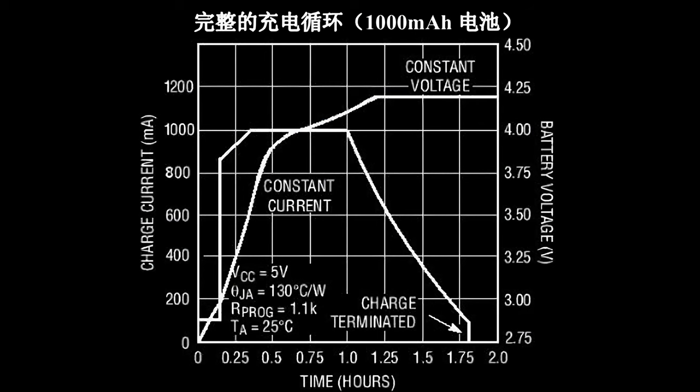According to the datasheet, three different charging methods are used. When the battery voltage is lower than 2.9V, the chipset will charge the battery with only 130mA. This is called trickle charge or recovery charge. It is needed to charge the battery without damaging it until it can receive high current, which makes the TP4056 able to charge an over-discharged battery.